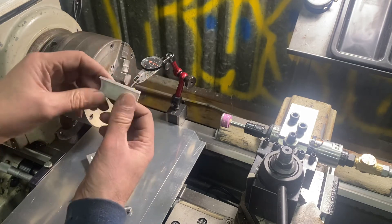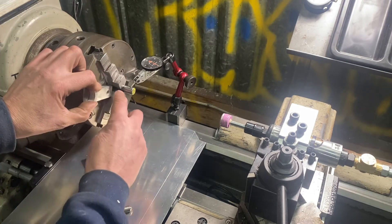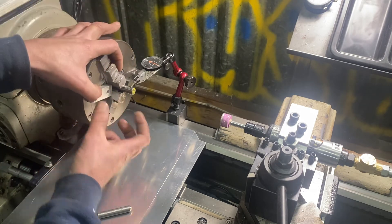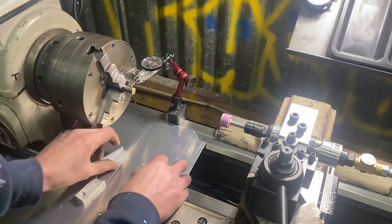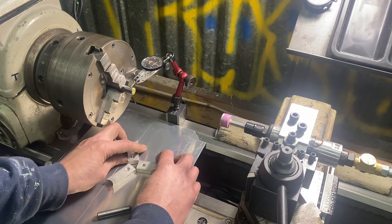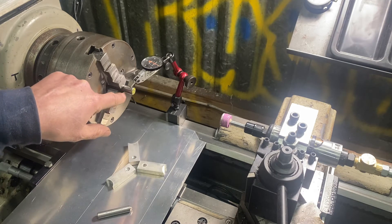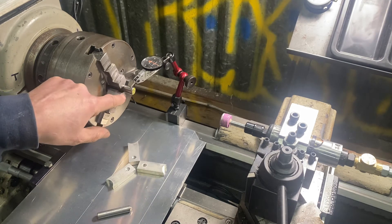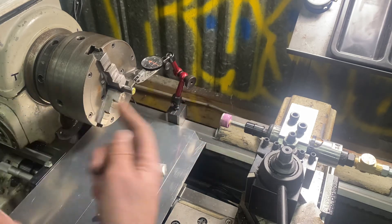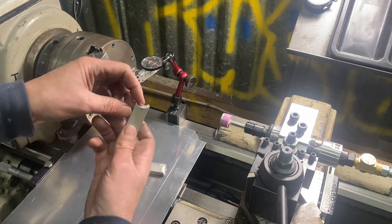What I did was I took some square aluminum stock and made myself three little pieces. There's a flat here and a flat here, so they slipped down in there. I did three of them, pushed them all the way together, and basically it made a little triangle at the center of the chuck. Then I went in with a boring bar and turned just shy of the jaws, stopped there, and then came in and ground everything down to where it was nice and true.